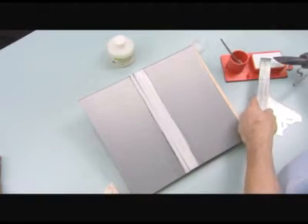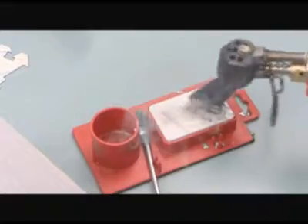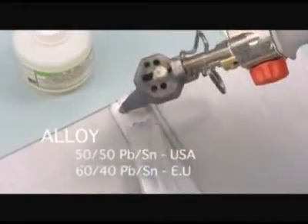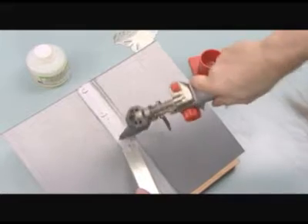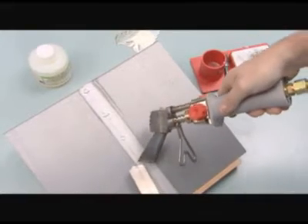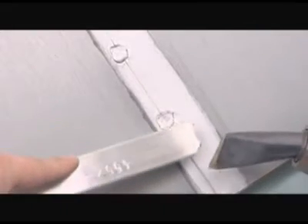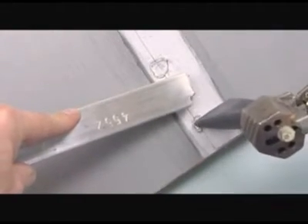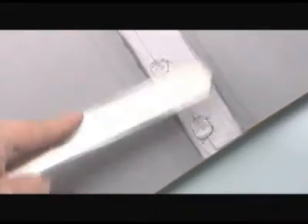The ammonia block is used to strip the tip of the Express soldering iron. The tin soldering stick or soldering metal consists of an alloy of lead and tin. Tacking makes it possible to join the two pieces so as to obtain perfect capillarity. Tin the tip of your Express iron, then carefully take a drop of soldering metal with the tip and apply it to the desired place on the VM zinc. Let the soldering metal penetrate the zinc to create a soldering spot, and maintain pressure with the soldering stick until the metal cools down to obtain optimum capillarity.